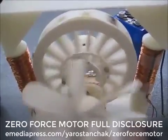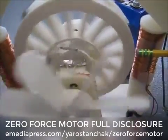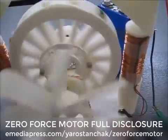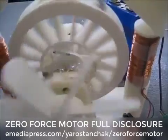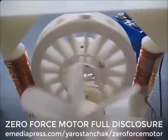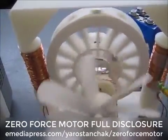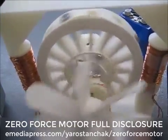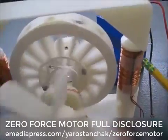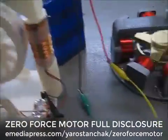An explanation of that is: normally the poles on the motor are facing this direction and on the other side the opposite direction, and you go across the top of the coils. But this motor doesn't work like that. This motor is completely different in that it's riding the flux lines that go around the outside of the coil like this. Let me show you a drawing — I don't want you to confuse this type of motor with this type of motor.